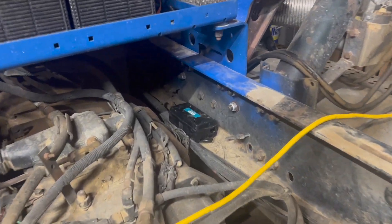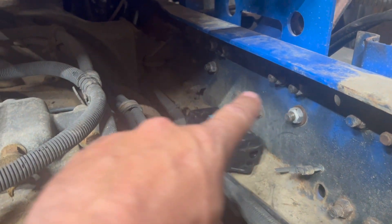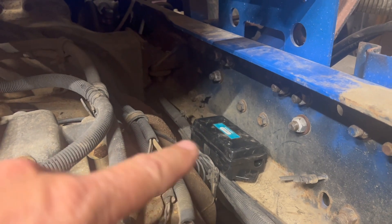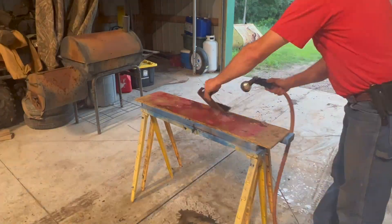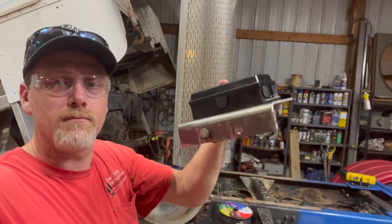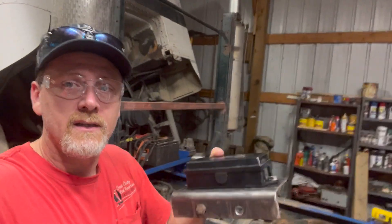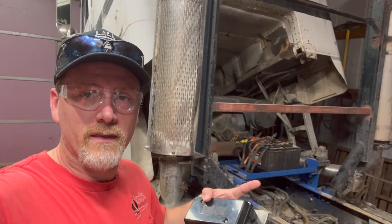What I've got going on is I'm going to mount that box. I've got to find a piece of angle iron that I can bolt to those two bolts there, and then we'll mount that box on that angle iron. We're back in the shop and I've got my wiring junction box all done, bracket made up for it. We've just got to prime it, paint it, and then stick it right back in there, and then we're ready for wiring.